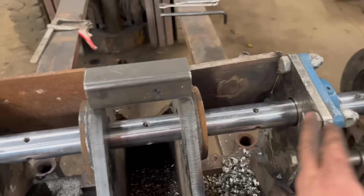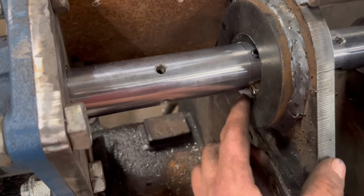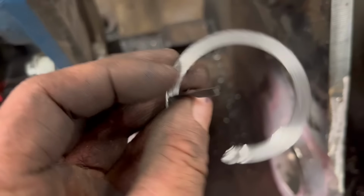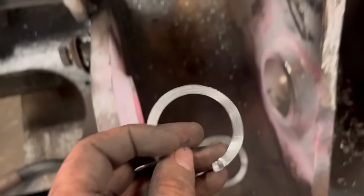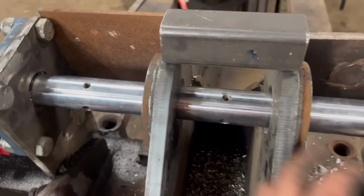but I could do with another bearing. Bearings are a bit far apart, I think. But hopefully now, if I'm not doing as deep a cut, it's like a 5mm depth of cut on there, it might not chatter as much, I'm hoping. So I'll measure what the whole diameter is now, and then move the tool out and go through them again.